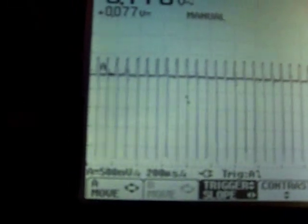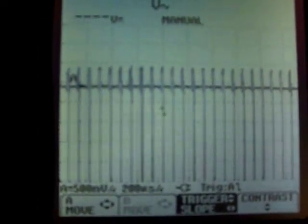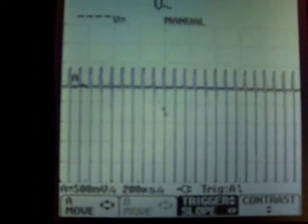You don't want too high gate resistance because as you go up in gate resistance you can reduce the negative spike on the shunt. So you can see I'm going down to zero resistance right here on the shunt — I'm going to kill the oscillation — but you can see the spikes are off the chart, and this is not what you want.